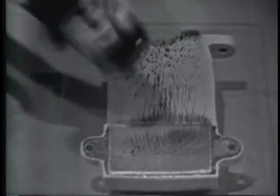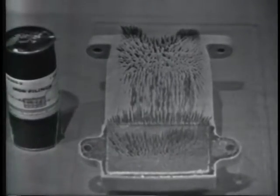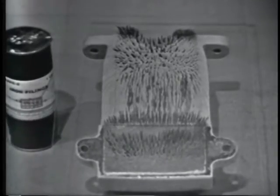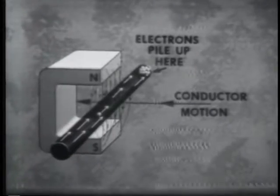In this method, all that's required is a magnetic field, a conductor, and motion between the two. A magnetic field is similar to the field around a charged body. We can get an idea of how this field exists by using iron filings and a magnet. I'll sprinkle some filings on the glass covering this magnet. Notice how the filings form into lines indicating the shape of the magnetic field. When a magnetic field is brought near a conductor, it will force the free electrons of the conductor to move toward one end. The end that gains electrons will be negative; the end that loses electrons, positive. Since charges are developed in the conductor, a voltage must exist across it.